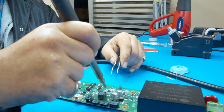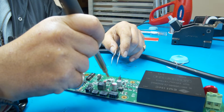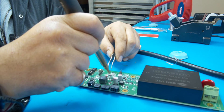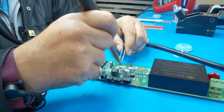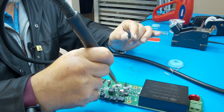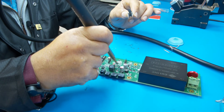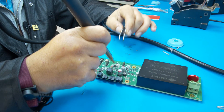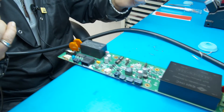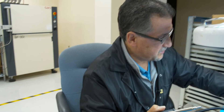You want to keep moving around the hot air nozzle — you don't want to keep it straight on there. Once you notice that it's starting to flow you can pick it up with the tweezers. It's very important not to stay in one position for a long time because you can burn the board. There you go — and then it pulls right off. Place it down.